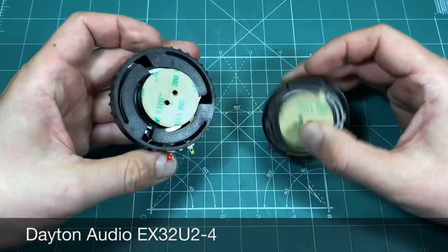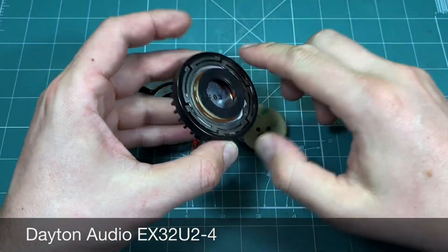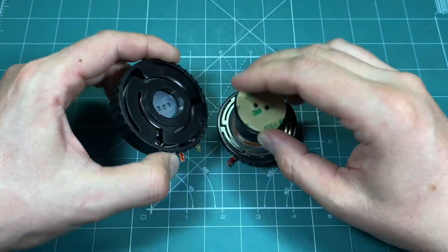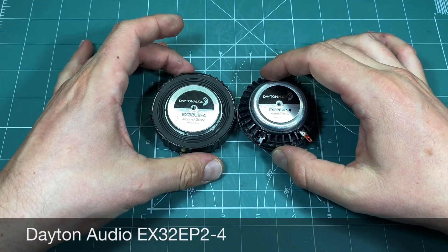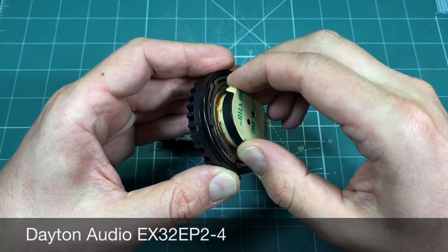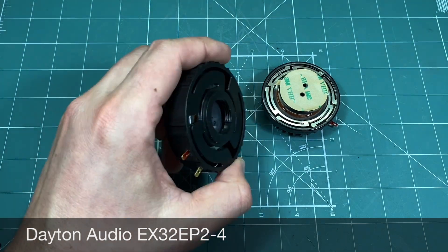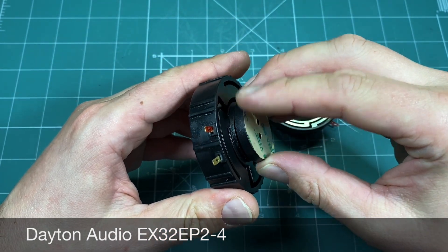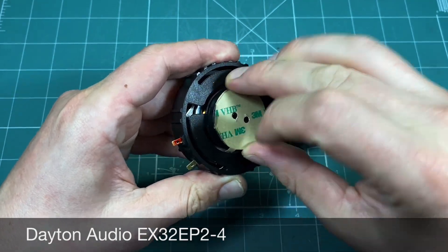Finally, let's look at our two favorite contenders. The 20W plastic one is very strong but unfortunately breaks very easily — after only 2 weeks of use both units died, so it doesn't seem suitable for tactile feedback. The steel spring 40W model is a very cool-looking unit with very good performance, and because of the heavy body you can definitely feel the vibrations. The downside is that at lower frequencies it more easily enters resonance and ultimately breaks the metal spring. With caution you can safely use it for high frequency effects, but for low frequency effects like engine sound or gear shift it's not advisable. The addition of the new mounting interface is a great upgrade and we cannot wait to see in the long run if this manages to fix some of its downsides.